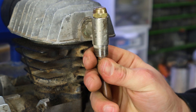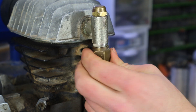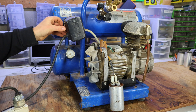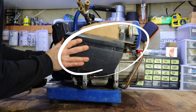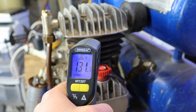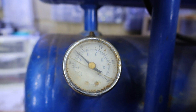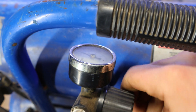To find that out, I'll reconnect the copper pipe so the air should be pushed into the tank. Now we can switch it on once again. I don't recommend letting air compressors run without the fan shroud, which is the part that directs the fan air to cool down the compressor. But for this demonstration, I won't let it run for too long to make sure it doesn't overheat. If we look at the gauges, we can witness the pressure slowly rising. It is also way quieter than before, since the air isn't leaking anymore.